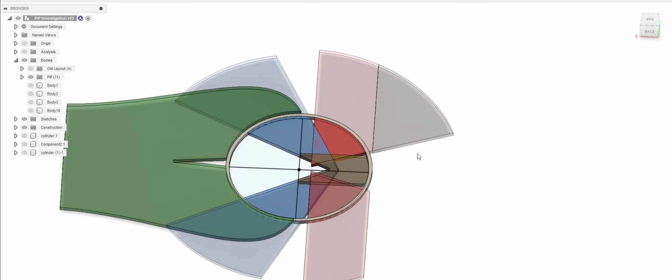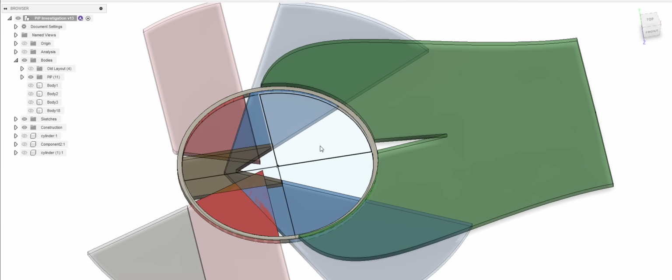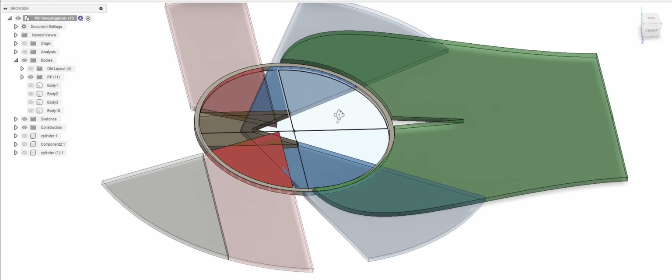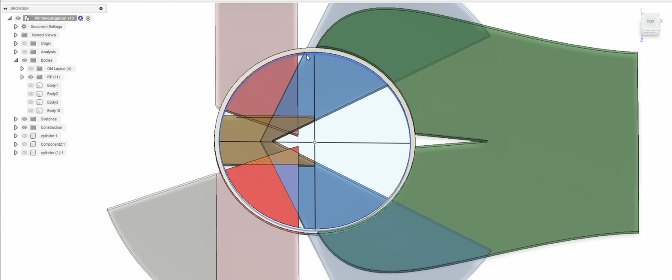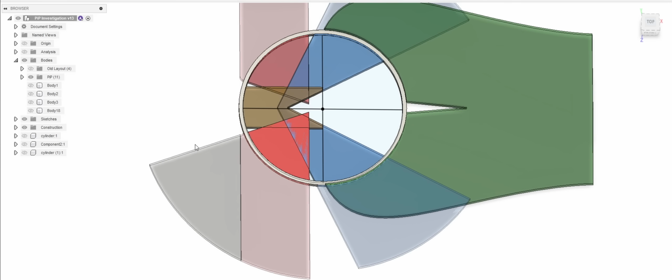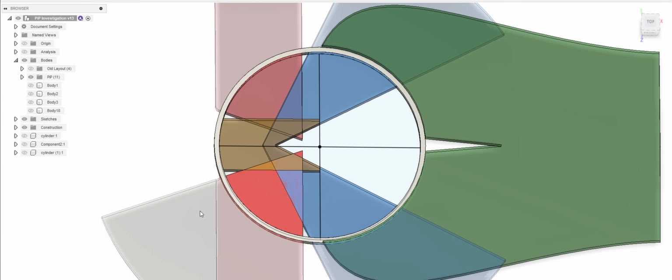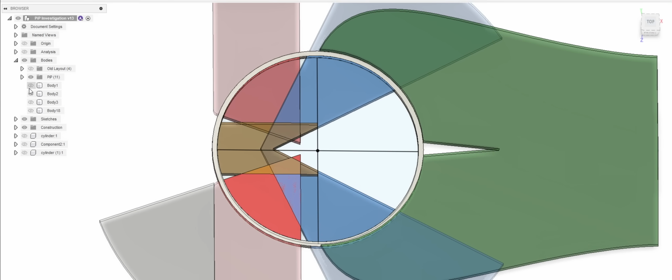So here you can see the transfer and exhaust port layout of the current cylinder. These are the A ports, and that's the bore, so the port windows. And here you can see the angles of them. And you can also see the gray bit here. That's what I've blocked off with a 3D printed insert. Because here's one thing I screwed up.